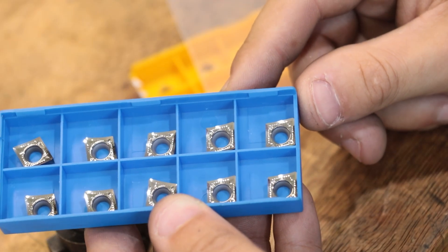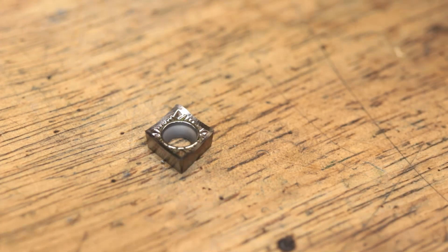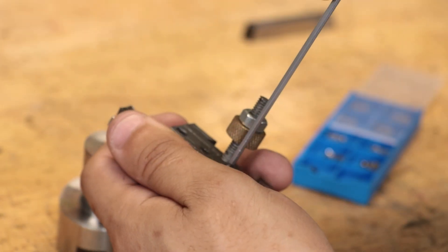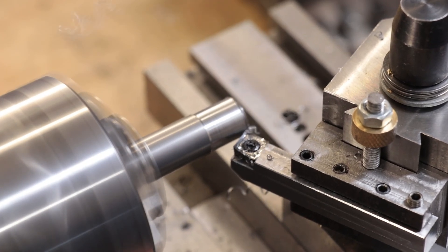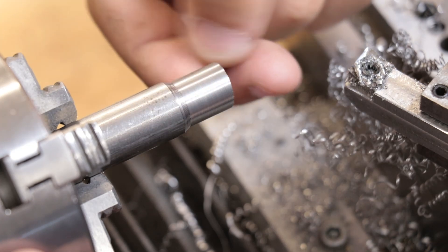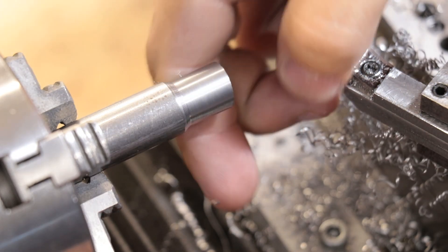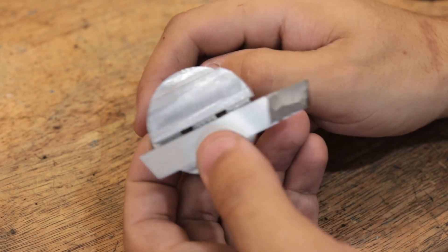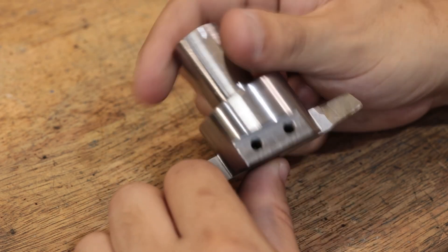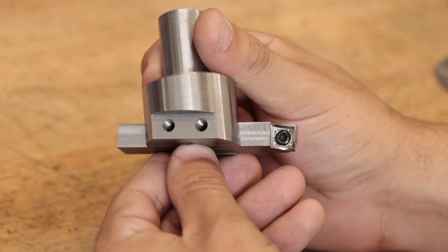Granted, these are no-name inserts that I picked up off the internet for about 15 bucks, so I can't expect all that much from them. However, some of the import inserts that I've paid about the same amount of money for have worked remarkably well. To see if it was the inserts, I put the tool holder in the lathe and turned down some 1214, which is one of the easiest materials to get good surface finishes with. And whilst I got close, I didn't get anywhere close to something that I'd call shiny. So I'll probably swap out these inserts for name-brand ones when I come across them. I could use high speed steel, but in my opinion carbide leaves a much more consistent finish across multiple parts and a better finish than high speed steel. So until I get the new inserts, I'll probably stick with these old ones or the button inserts depending on what I'm doing.